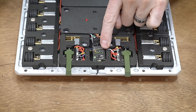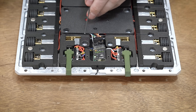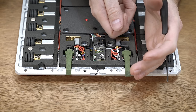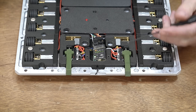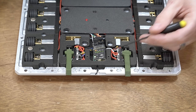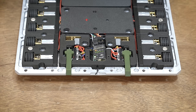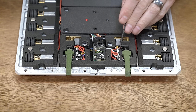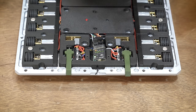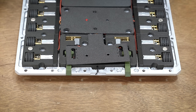The radio sits inside in its own little home. You might notice there are little pieces on the back with a screw on each side — these come out and allow the motor to actually pull out, because there's no other way to get these motors in and out without some kind of rear access. So there's one main piece, the access panels, then the two microswitches, then the diodes. The microswitches didn't have a great mounting solution, so I've got dowel pins pressed into the body that line up with the access panel.